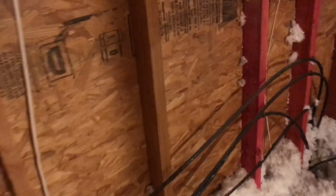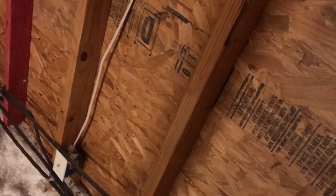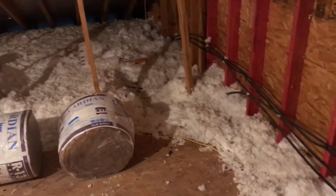There's also other shady stuff — like this exposed junction. I don't understand because for that floodlight there was probably space behind the trim plate to do this junction properly, but instead they wired it up in the attic with no box. They could have put just a receptacle box here — anything to put this connection in a box. It's aggravating that the inspector signed off on this house and didn't catch any of it, because the buyers could have had all that fixed as part of the sale contract.